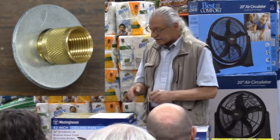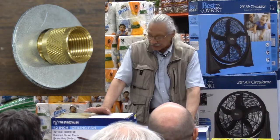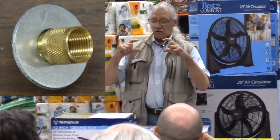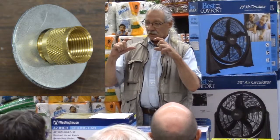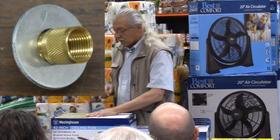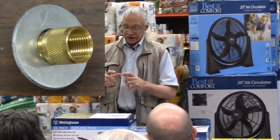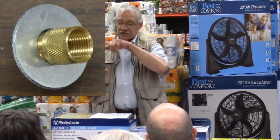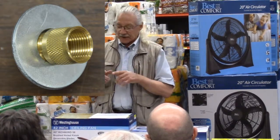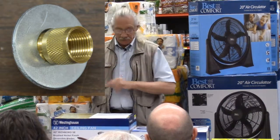Normally the brackets that come with a ceiling fan, there are three different types actually. For a hugger, you usually have a long flat plate of some sort with a hole in the center. For the down rod, there's two different types. There's a type that is a round pan with extensions on it to hold the ball of the down rod, or then you have a top hat, which is like a bent bracket.